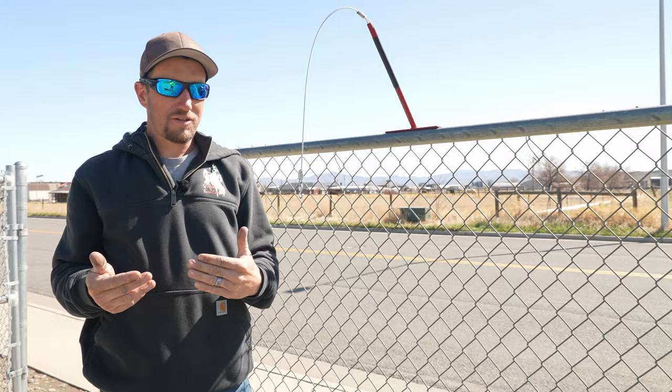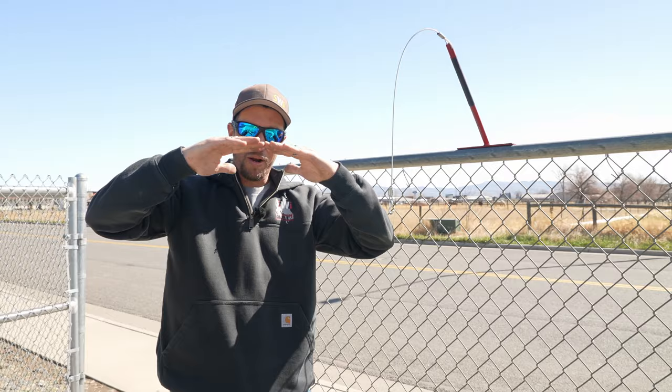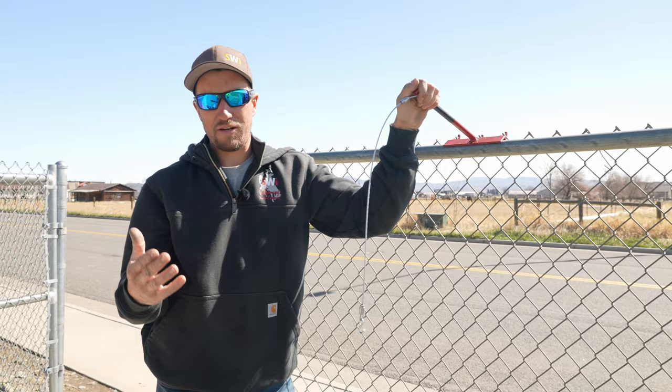That's also another reason behind the top rail dressing tools. If you're in the middle of a section and you have two pieces of top rail that come together at a point and you want to flatten that out, you're going to take this on that peak and push that top rail down, then tie the chain link, causing the top rail to stay in the position you want it to be in to get that flow to look really nice.